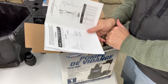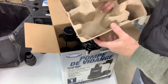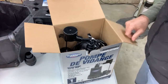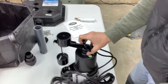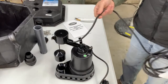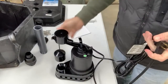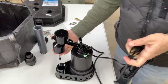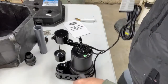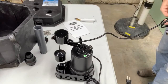I think that'll handle what I need, but I want to do a test on this thing. I'm going to take it outside, fill the bucket up, and see what it does. There are two cords — this one here is actually the float switch, and you plug in like that. So only when the float raises up does it allow power to transfer to the pump. That surprises me a little bit that they're separate like that.